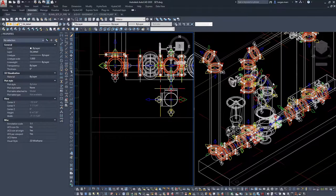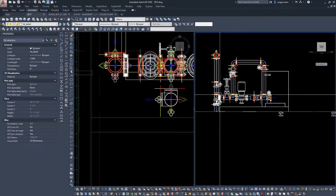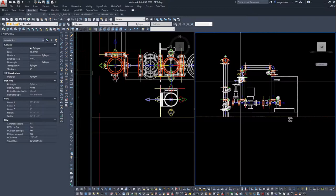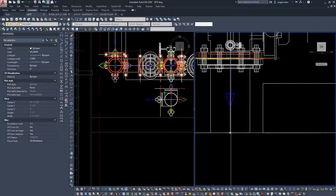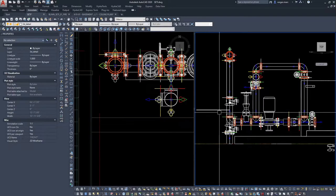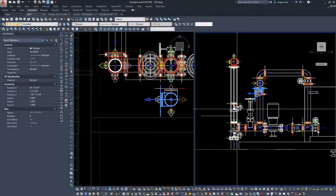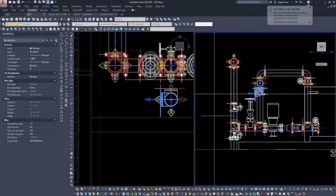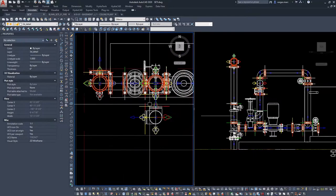And then if we go to our front view, let's just go up 36 inches here. So I'm going to want the manifold to be about 3 feet off the outside ground. Usually it's minimum between 3 and 5 feet. So we're just going to drop down 24 inches from that. And as you can see in the top view, it still looks the same.